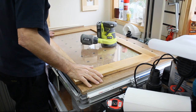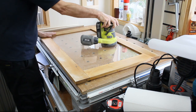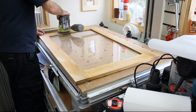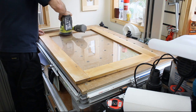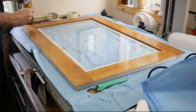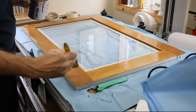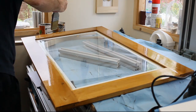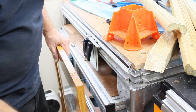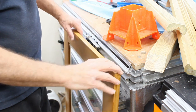That's the glue-up finished. I've stuck the other side on now, bedded it all in mastic. I'm just going to give it a final sand of the base coat before I give it a top coat. Now we're getting there — it's been stained and given a coat of external clear varnish. So that's now pretty much ready, the screen itself.